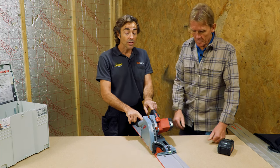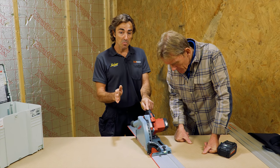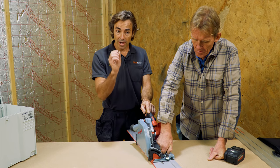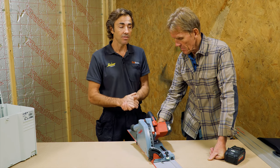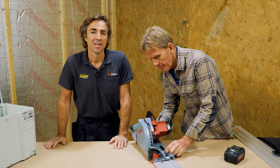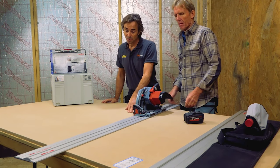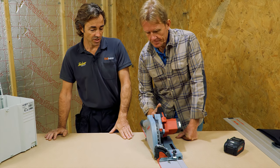What this saw is doing on that second full pass is moving the blade away from that scribe cut by one tenth of a millimetre. That means you're definitely not going to split or chip the surface. So that's quite a nice feature too.